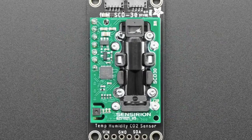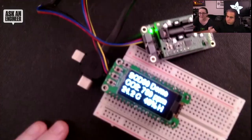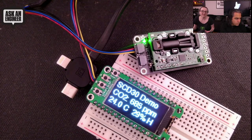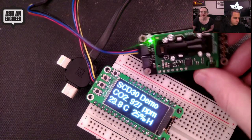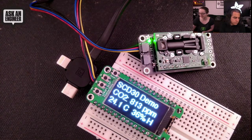You can even see that glowing light — that's it performing the sensing in the cavity inside the plastic body. It's a really cool sensor. They're not as inexpensive as a basic air quality sensor because it's doing true CO2 sensing, but it's 60 bucks and there's nothing less expensive that does the real thing. Right now it's measuring indoors about 800 ppm, which isn't unusual — it's winter, things are closed, not a lot of air circulation. If I breathe near it, you'll see the CO2 rise. In the demo video, a compressed can of air increases the CO2 noticeably.